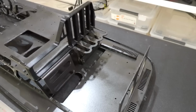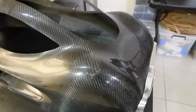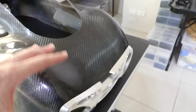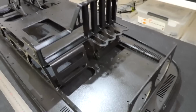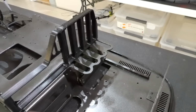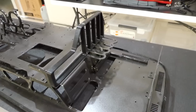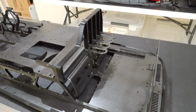Now, because you need access to this area to plug and unplug components, we decided to attach that carbon fiber shroud to the inside of the shell, so that when you press the button at the front, the internal cable shroud actually rises with the shell. They're fixed to each other. So that means that with the press of a button, you can get instant access to the rear IO. And then it's just a simple matter of threading cables through and then pulling them up and plugging them in. So that was something that was very important, and we had to put a lot of time into designing, coming up with a solution for running the cables, which would normally be external on a case, internally, but keeping them really clean at the same time.